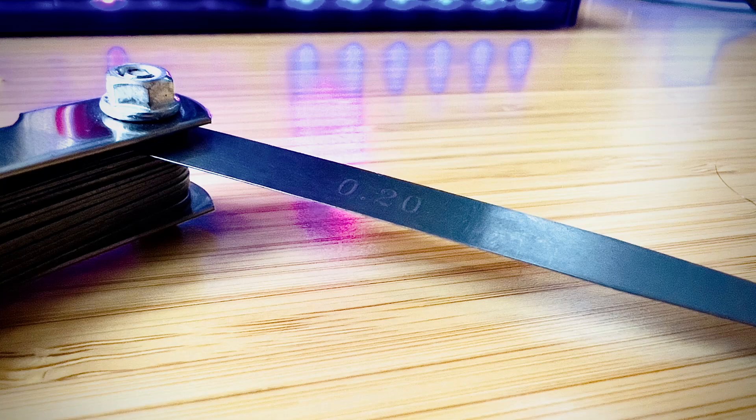The last thing I did was just level the bed a bit. I used a feeler gauge at 0.2 millimeters to get things roughly level. I'll use the data from the BL Touch I have installed later to get it more exact. In the past I've been able to get everything level within about 0.04 to 0.06 millimeters, and right now it's at about 0.4 millimeters, so we've got some improvements to do there, but that's okay.